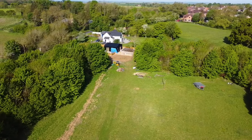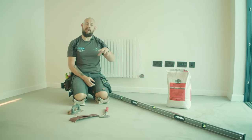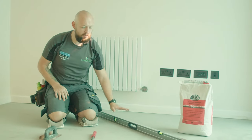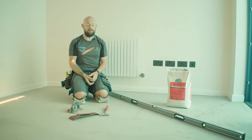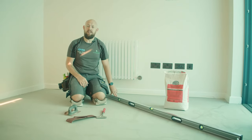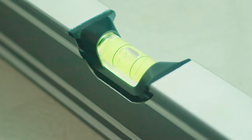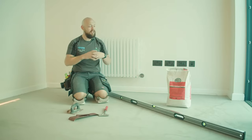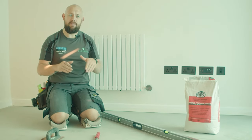You can come in the next day to start fitting your resilient floor covering if you wish, but on this project we're giving it the weekend to cure and we're back Monday morning. We've come back, applied our smoothing compound, and we're ready to install our product. We're going to check our surface regularity levels — SR levels. As floor layers we have to get it to surface regularity one, so that floor has got to be pretty bang on. You can test that with a two-metre straight edge. As we can see, it's pretty bang on. Because of the flow capabilities of Ardex's product, it saves a lot of hassle. If there are any little imperfections, we can use the Ardex feather finish to help resolve those.